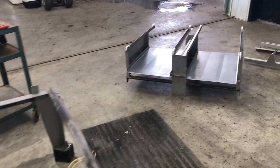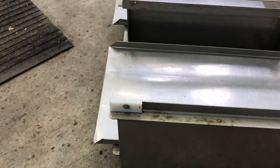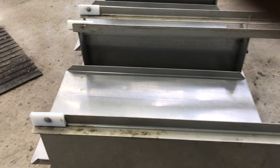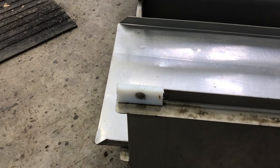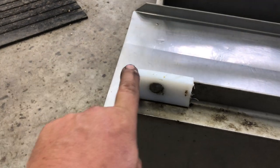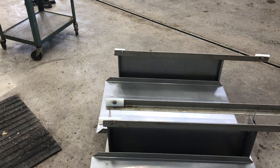Another thing I've done on this machine: these are the unloading racks. This is actually a sliding rack, but there are little ball bearings that go on here to hold the rack that the frames go on, and those things never really worked all that great. So I replaced the ball bearings with a piece of high-density plastic, and they slide back and forth really nicely — my workers quite improved by that.